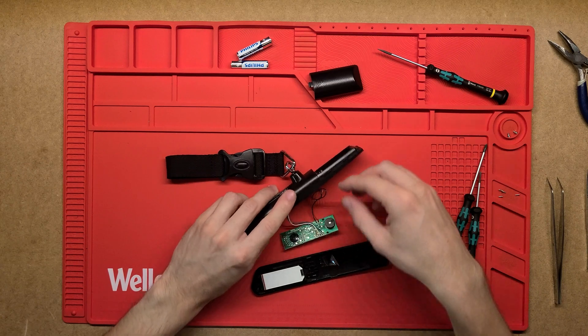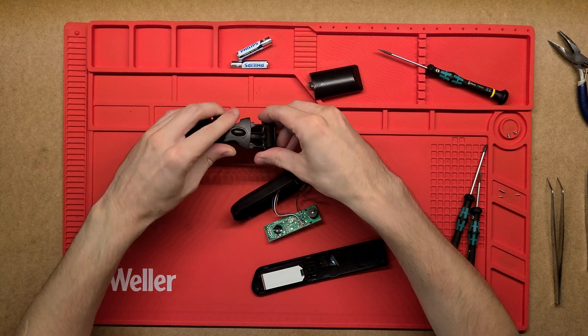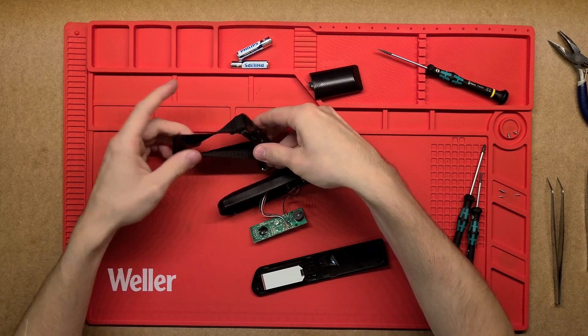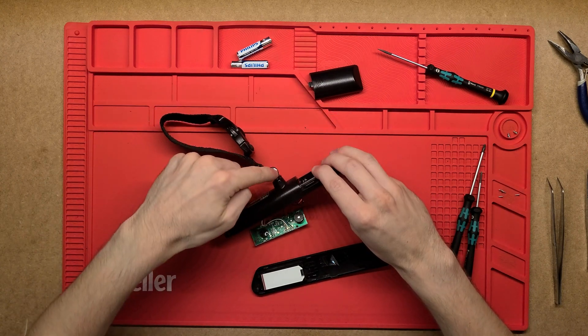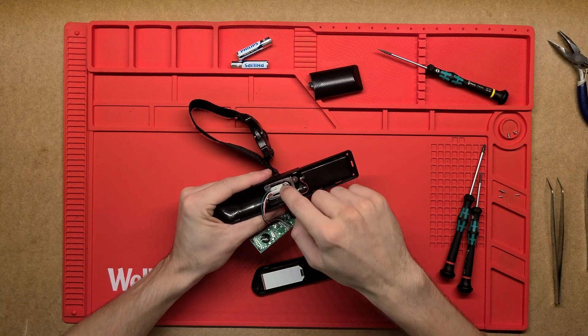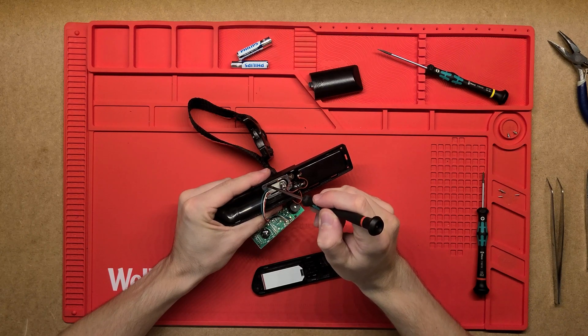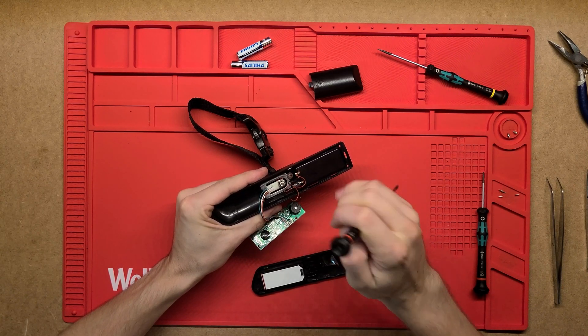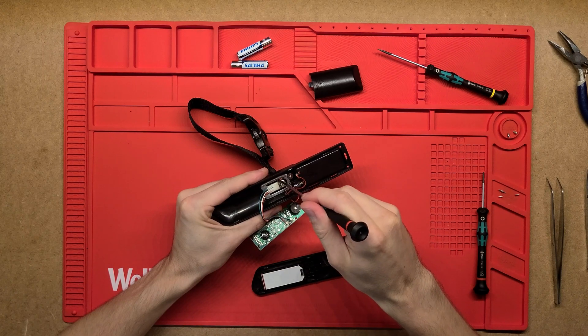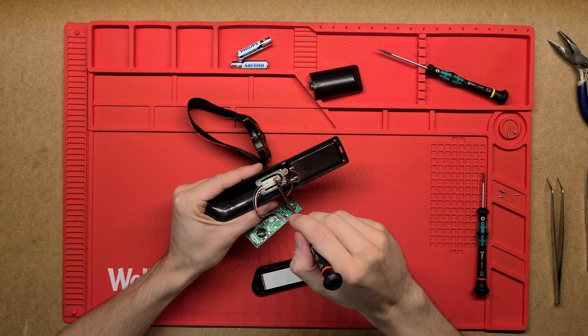So we've got a little strap which is just a click that you can click around a handle of luggage or something like that. Metal handle or sort of eye hook that comes through and is mounted to this. So this in here is the actual load cell which is really just a piece of metal that's got a certain shape to it, so the part where the mass is sitting can actually deflect and bend down.